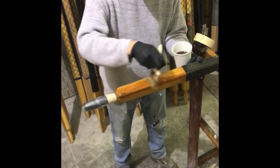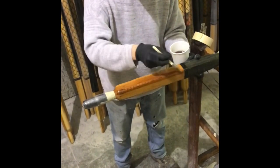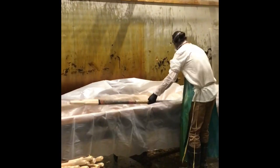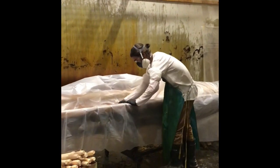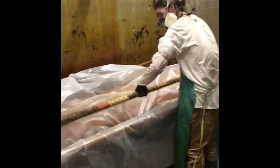It's always good to put on at least two coats, maybe three, depending on how you're applying it. If you're wondering if you've got enough varnish on there, just remember that when we have a brand new oar, it's completely dipped and submerged in the varnish. Spread it out over the top of the oar and make sure it covers the entire oar, then hang it and cure it.